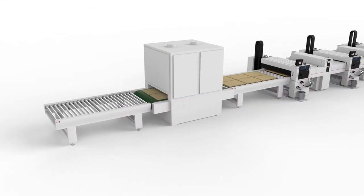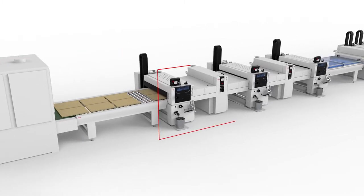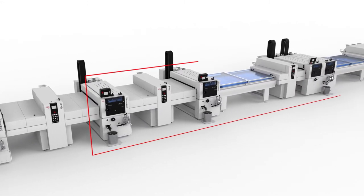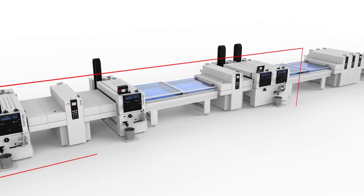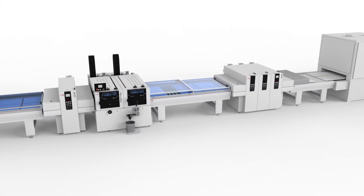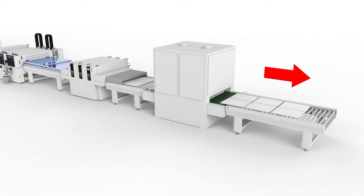The application techniques currently known include roller coating lines. The classic makeup of a roller coating line is: substrate sanding, application of primer for adhesion, three base coat applications with single and double coaters and intermediate gelling, final drying, and base coat sanding followed by finishing.